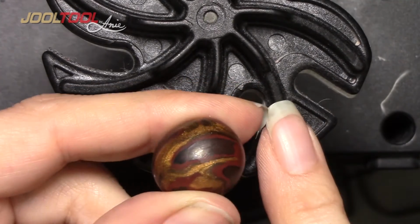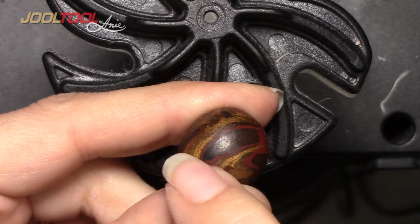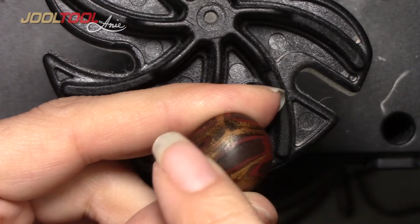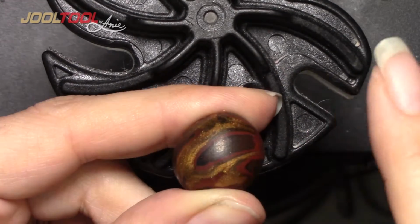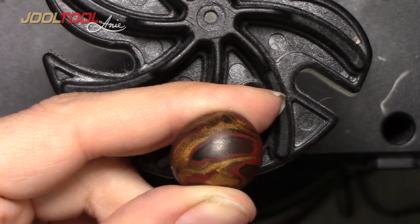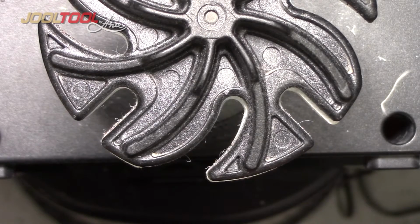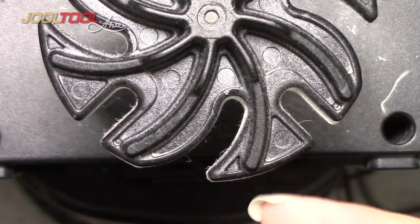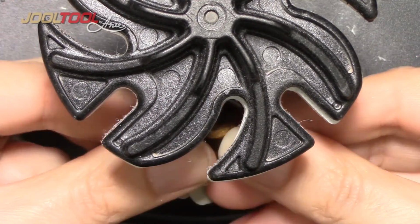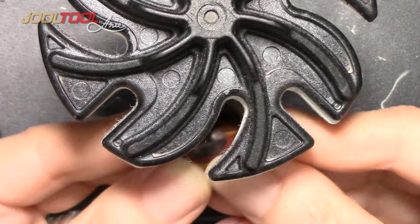Now this step of sanding is going to eliminate all these microscopic little pores and give you that really nice smooth finish in an even sand. That's what these 3M wheels provide, a nice even sand. And then we're going to follow it with the next 2 steps. So I will run this wheel at a slow speed, and you'll see the motion in my hands. I will be holding it like so, rocking up, down, left to right, and even in a circular motion.